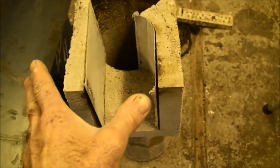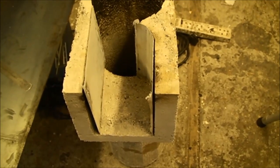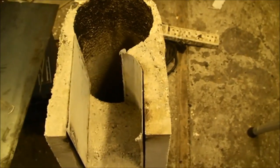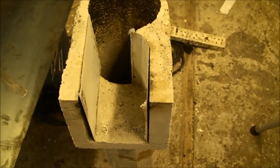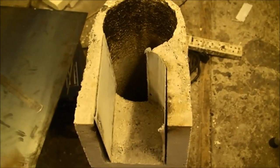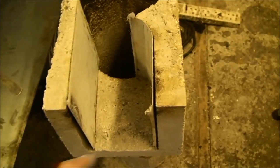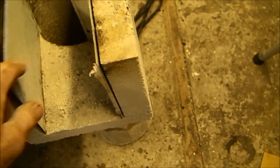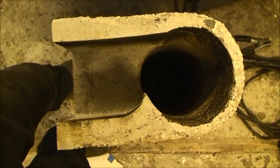What I've done — when I originally cast this riser tube, I made the entrance larger than it needed to be because I wasn't quite sure of my sizings. So once I got my firebox built and figured out the size of the riser tube and firebox, I reduced this opening to create that vortex within the riser tube, because as it was it was just too big. All I did was put these two pieces of tin in there, and then I poured some more refractory down the back of it to reduce that entrance and create that profile — there, you can see.